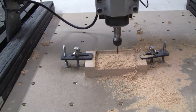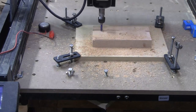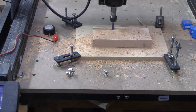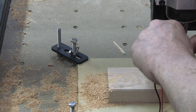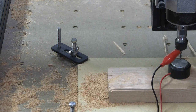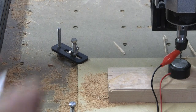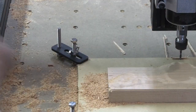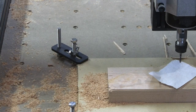I didn't stand over it and watch all this because that would have taken a long time. I started with the quarter-inch flat carbide and then switched to the eighth-inch round nose carbide, using the Z probe to set it up. I clamp a wire to a place that grounds on the tool, press a button, and it goes down and touches the pad very slowly, then lifts up and stops at a given amount — I think it's 20.4 — which is exactly how far the tool is away from the work. If I go down to zero, I just touch the work.